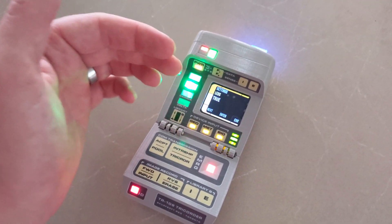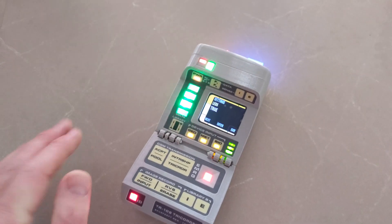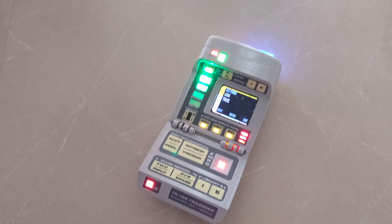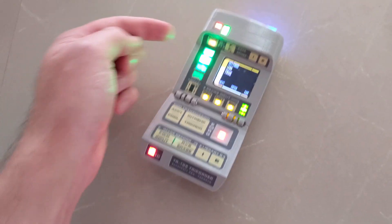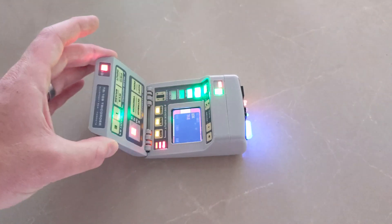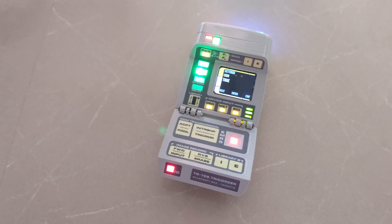Screen draws have been slowed down because all the threads are really just sharing one thread, and it's chopped up and given to each of them one at a time, piecemeal. So it's not actually faster, but it does mean that my lights and the door respond instantly, whereas before it would have had to wait for its point in the loop.